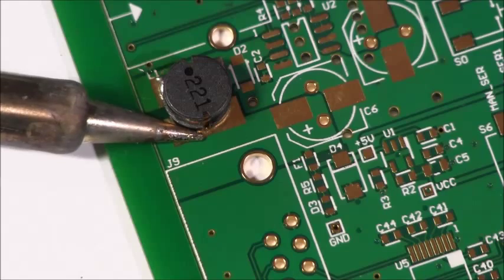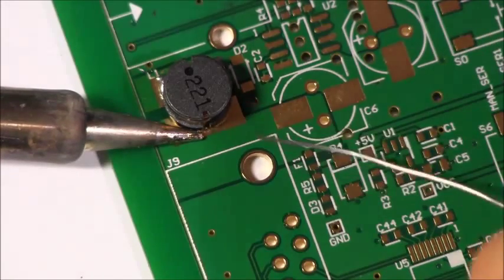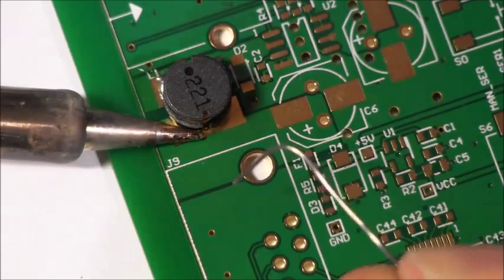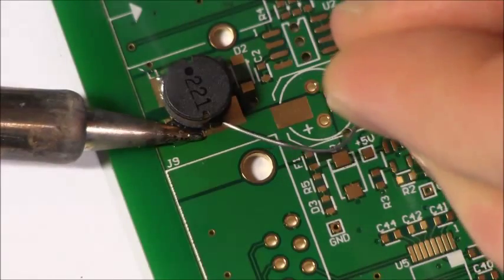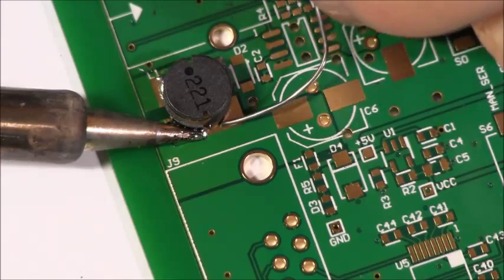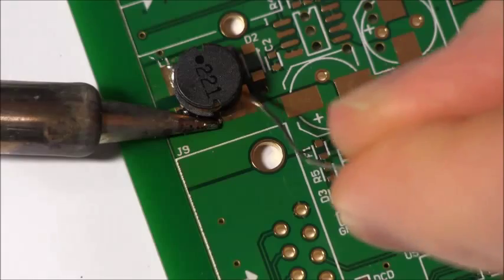Now we'll come to the other side. Double check that we're nice and flat, and get ready to do the other side. We're going to heat up over here and start dabbing solder on the other side. We're going to wait until the heat flows through — you might get a bit of it going just by touching the iron there. What we should see is the heat flow all the way through this pad and be able to melt the solder on this side. Your iron is not actually at 800 degrees at this point, maybe on the outside edge, but it's really just trying to heat up this pad, and the whole board is going to get warm.